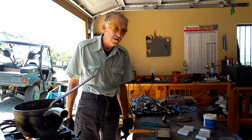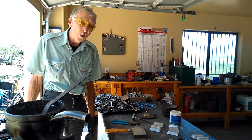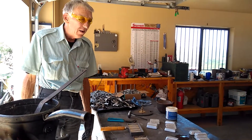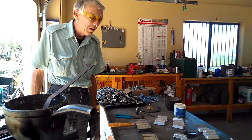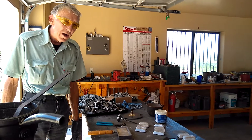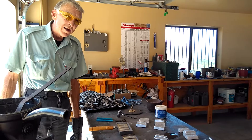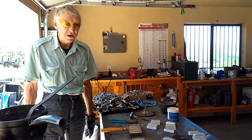And then we'll weigh it all up, see what we got out of 44 pounds of wheel weights. A lot of these old wheel weights, they're oily and greasy. You've already got some kind of oil there. I know a lot of people do wash them in gasoline and stuff, but all that greasy oil stuff, in my opinion, does help with the fluxing process. I drew some wax on the wheel weights just for good measure.